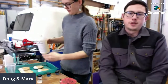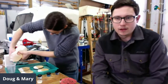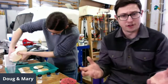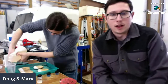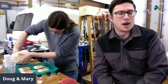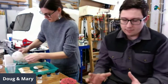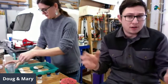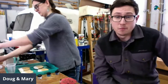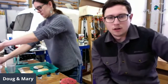Yeah, if you're going to share it with your chop saw or miter saw, if you can get a splitter and you wanted to do a dedicated small dust collector, the size of this Rikon I've got is probably about right. You could split that into two and neck one side down, and then for the miter side, leave it as big as possible and run a 4-inch to behind your miter saw.